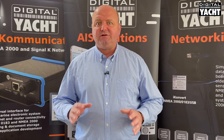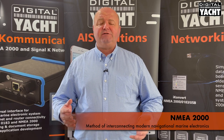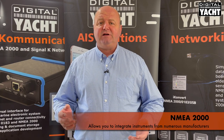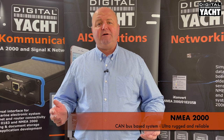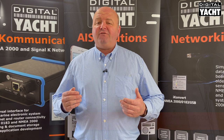So let's take a look at NMEA 2000 in general. NMEA 2000 is the marine industry's method of interconnecting modern navigation electronics. You can integrate instruments, GPS, and autopilots from a variety of different manufacturers, allowing data to be shared across networks and systems. It's a CAN bus based system, very similar to automotive CAN bus systems — ultra rugged, ultra reliable, but not particularly fast. An NMEA 2000 network runs at 250 kilobits a second and up to about 50 devices can connect, but there's a lot of error checking that goes on to make for a really reliable network.